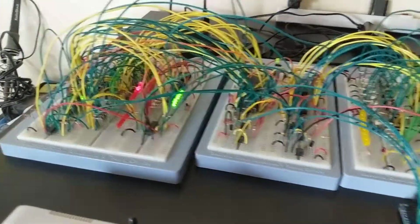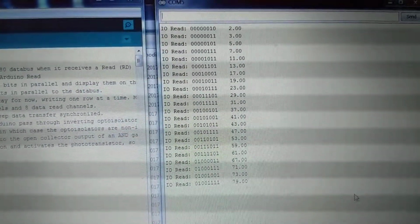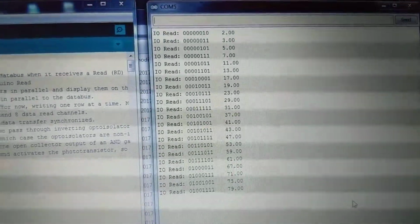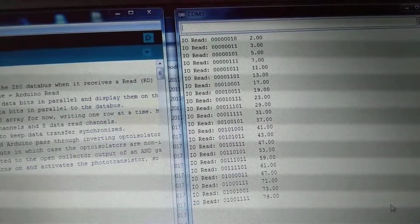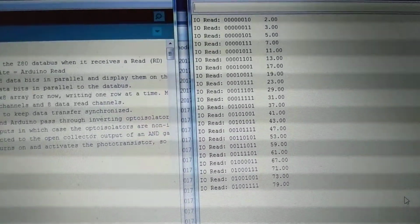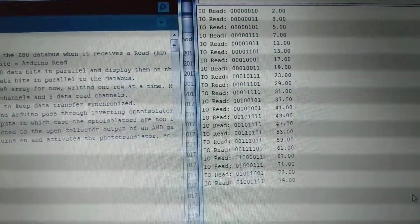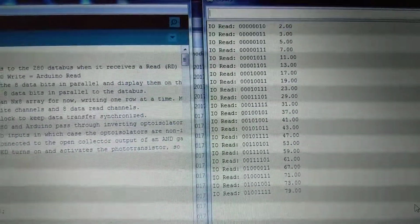So the thing is, though, as you can see on the list, notice it's taking a really long time for 79, right, to calculate the next prime number. That's because the bigger the number is, the more times you have to check using the repeated subtractions, right? So to calculate 79 as a prime number, how did it have to do it? Well, first it had to start out subtracting 2 from 79 repeatedly until the result was negative. Then it had to subtract 3 from 79 repeatedly until the result was negative. Then 4 had to be subtracted repeatedly until it was negative. And you just repeat that process over and over again until eventually you get 79 minus 79 equals 0. And that's how you know 79 is prime.